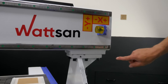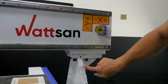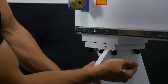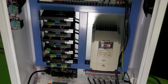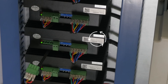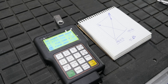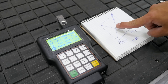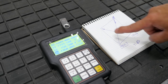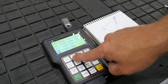Let's proceed to alignment. For this you need to remove the protective covers on both sides of the gantry. Loosen the bolts fixing the gantry and the supports. In the control cabinet you have to disconnect one of the two Y-axis driver controllers. Then use the controller to move our portal in high mode for a few steps depending on how much your diagonal is offset. In our case we made four short steps to even out the offset by 1.5 millimeters.